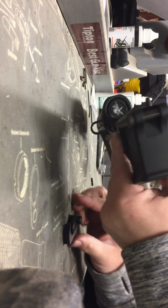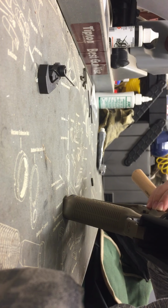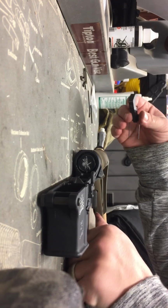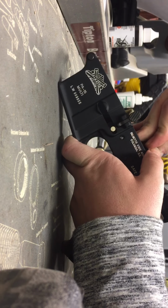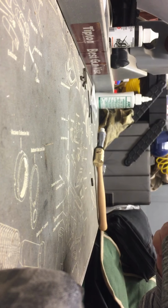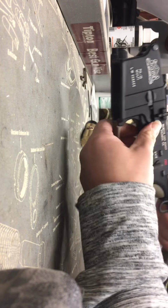What we're going to do is take the hammer, and I'm going to use the polymer side for this, just kind of tap, that way we can get through that spring tension, and then just make sure everything's lined up and set the pin. Alright, and now for the hammer, you have your two springs. You want to make sure that those springs are sitting on top of that pin that you just drove in for the actual trigger and disconnect. You're going to take that hammer and place it in. I always find it easier to engage it onto the actual disconnect to help you hook it. Line up your holes, and then take the pin, as long as it's lined up, place it in, and then just give a few taps to help push it through on that spring tension. Then just make sure the opposite side's in, and then we have it set.